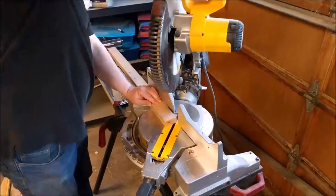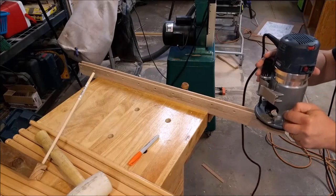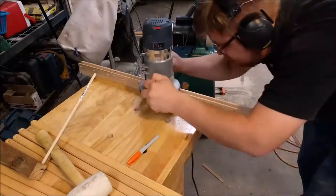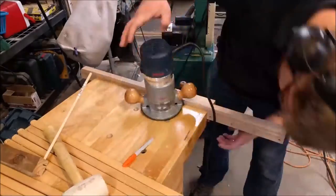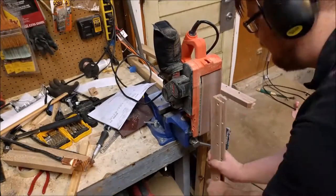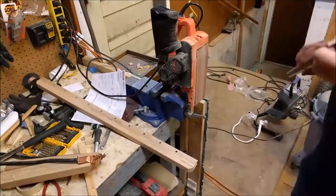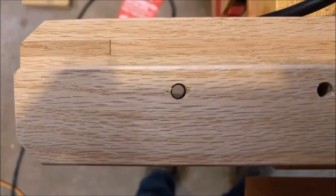Next we do final finishing. Cutting 45-degree angles into the top and bottom pieces means that when it's lifted up it won't hit the wall and gouge it. Next I use a round-over bit, but right here I make a mistake and don't support it so it drops down and leaves a permanent gouge. I learned from my mistake and make sure not to let that happen on the rest. Then I go through and route everything to make it look nice, smooth, and pretty. After that the belt sander gives a nice curve on that 45 so it's not so rough on the hands, and we sand the sides to smooth down every angle. Some of the holes near the center are less perfect and don't line up at all.